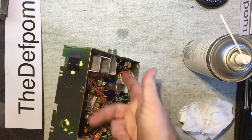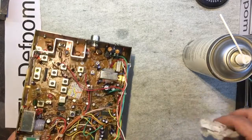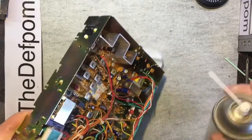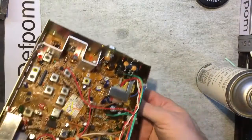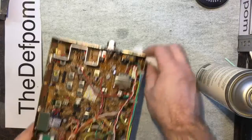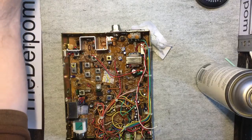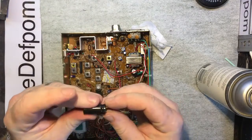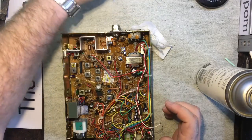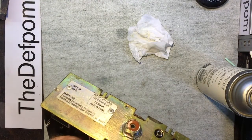I want to make sure it gets at least neutralized and diluted. It's not new — it's been gone for quite a while, but it's not looking that bad really. No harm giving it a wash. I found a 1000uF 50 volt replacement — let's put that in. It's about the same size, just a bit taller, but that doesn't matter.